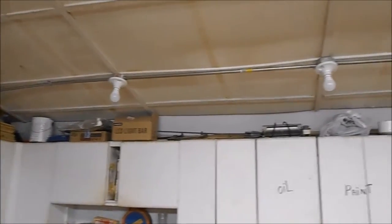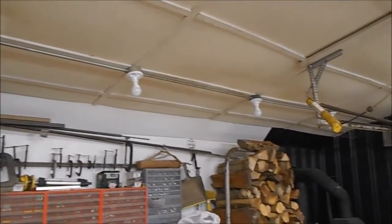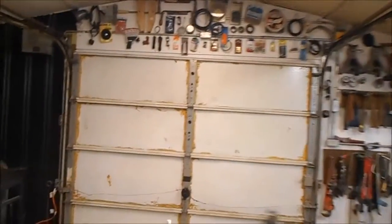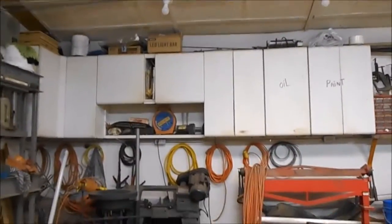We got all the lights wired up — five in a row, all 60-watt equivalent bulbs, with one down on the end. What I'm comparing them against are this row and this row of fluorescent fixtures. Our wattage on the fluorescent side is 320 watts over here, and those LED ones over there are only 45 watts. I personally don't think we're going to get as much light, but we're going to go ahead and kick them on and see what happens.